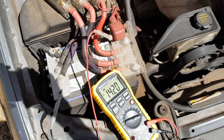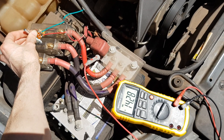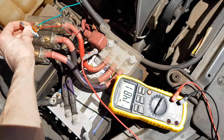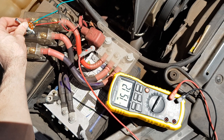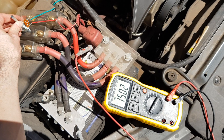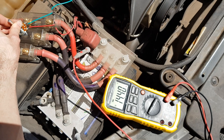It's sitting at 14.2V, and as I turn the potentiometer up — 14.7, 14.8, all the way up to 15.1, basically 15.2. So this is effectively a $5 external voltage adjustment knob, not $80.